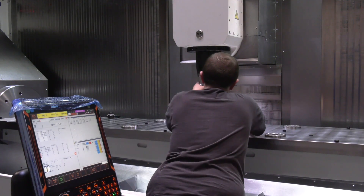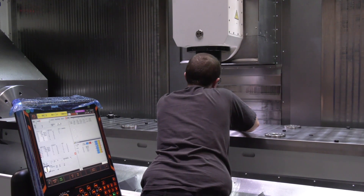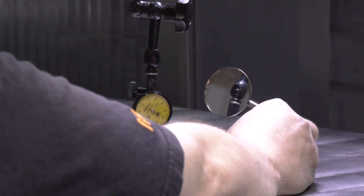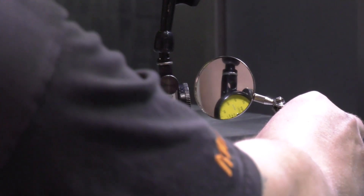I would imagine that similar parts would have been made years ago — how has the design of these fixtures changed over the years? As a fixture supplier we have to look more at single-setup manufacturing. This unit, for instance, can act in one axis as a vertical machining centre — it's got the tilting head as you said — but now with the trunnion unit on it, you can hit two sides as well, which is a massive benefit.